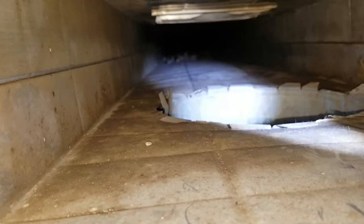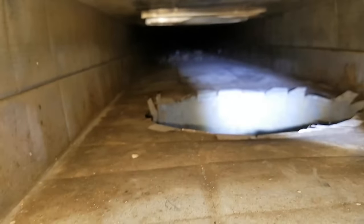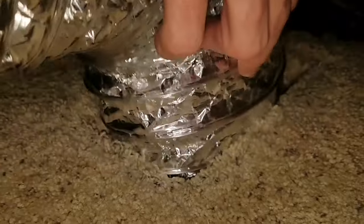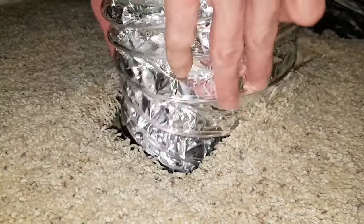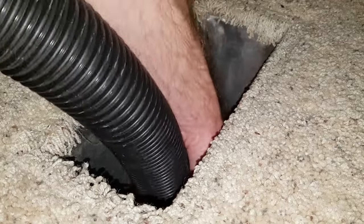The first pass with the whip swept most of the dust and debris out of this section. See where the debris is piled up. I continue sweeping it all to the other end of this duct where the foil hose from the vacuum is installed. After uninstalling that hose, I remove all of the larger debris that the leaf blower vac couldn't quite suck out. I direct the exhaust from the shop vac back out the nearest window.